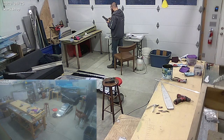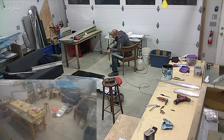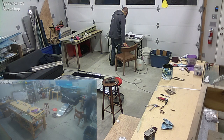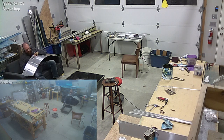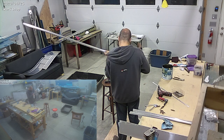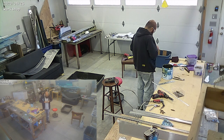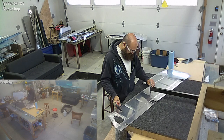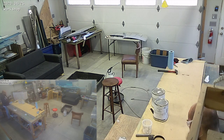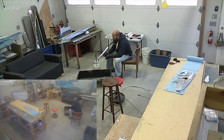And I'm also washing down parts and getting them ready because we are getting ready to prime these probably in the next day or two. You can see them sitting on top of the tub of pre-coat there. The pre-coat process is pretty darn easy. It's basically, you spray it down, you scuff it, you spray it down again, and you scuff it in the other direction, and then you just rinse it all off, make sure all the bubbles are gone, and rinse it all off, and then once it's dry, you spray it.